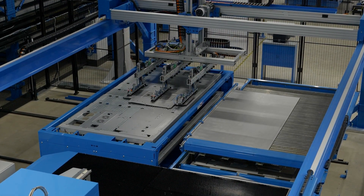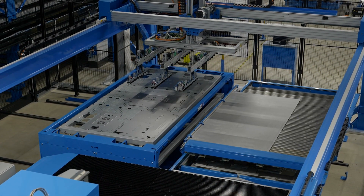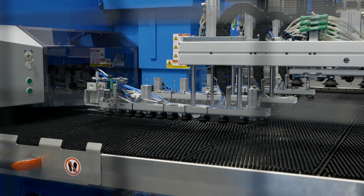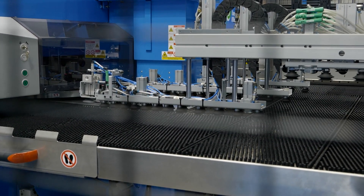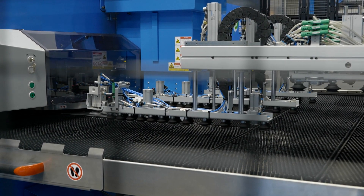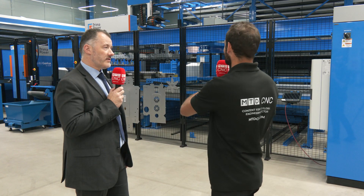It's completely modular — we can have all sorts of different automation solutions, from simply loading and unloading the sheet within the skeleton, discharging some parts, or going the whole extreme and picking and stacking parts. Watching it just now, the robot sits there waiting for the laser to finish the last little cut before it picks up the big part and takes it to the stacking station, ready to start on the next component.